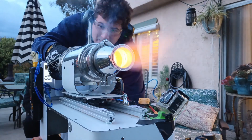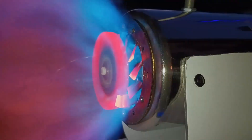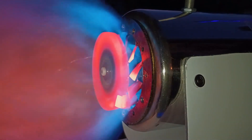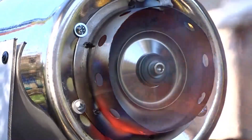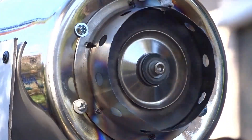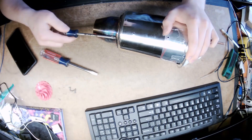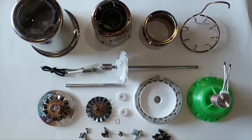For a jet engine that was unable to start, it still had many big successes. A key achievement was its resistance to heat warping — all hot end assemblies retained their shape even when going red hot, which was the primary issue with the last version, solved by using much thicker and more heat-resistant stainless steel alloys. This engine was also much easier to service, with an easily removable nozzle and stator plate.